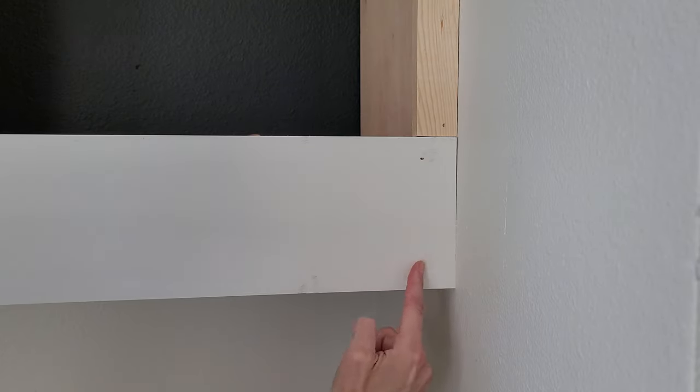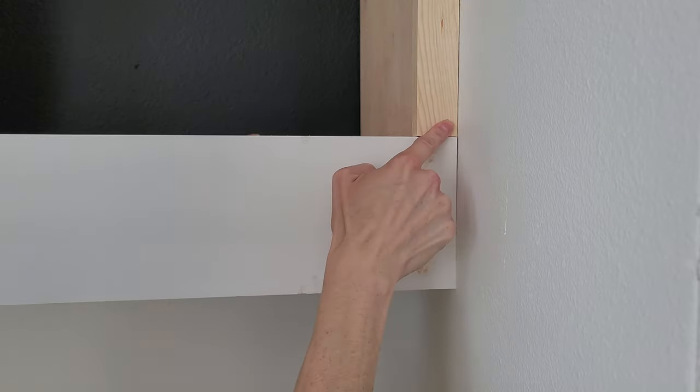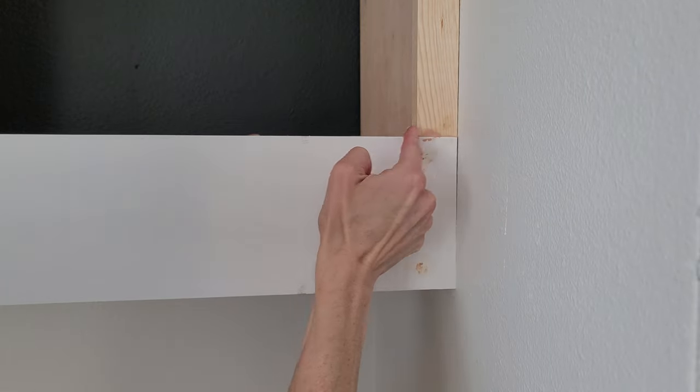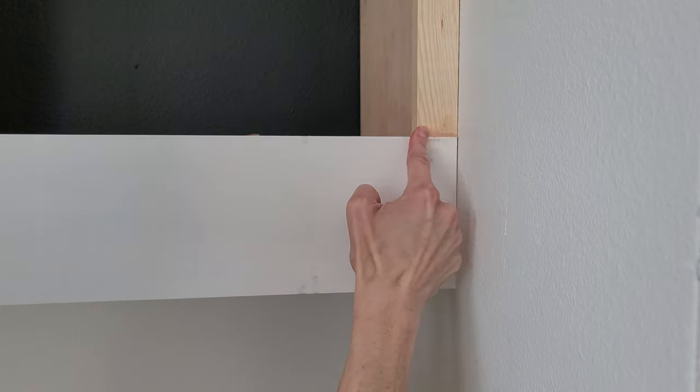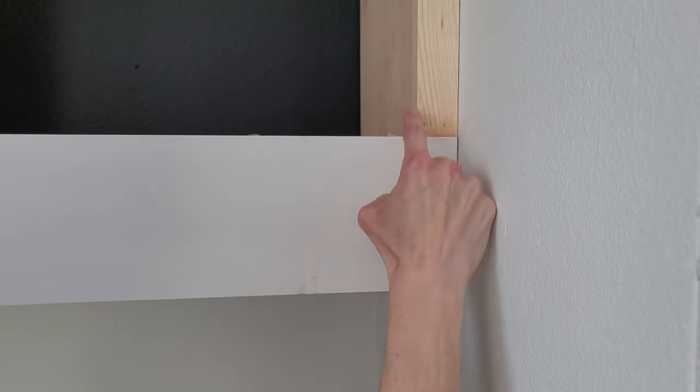For the inner face fronts I used a carpenter square because I didn't want them overlapping the middle column at all — I need to put my fixed shelves in there, and they'll have face fronts too, so I needed complete clearance. After you're done with all your brad nailing and screwing and seams, I like to take some wood filler — I like the pink stuff that turns brown when it's dry, so there's no question about when it's time to sand; I just look at the color.